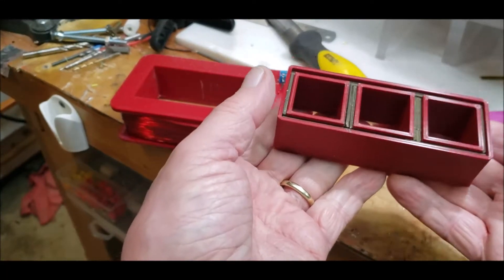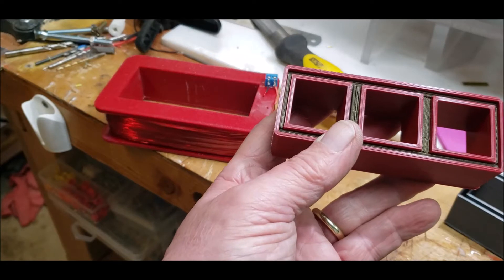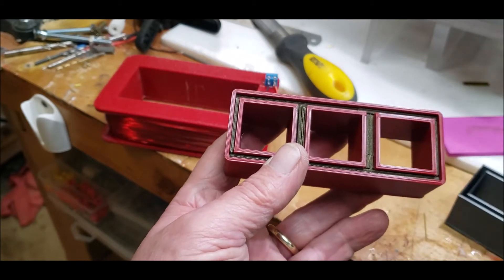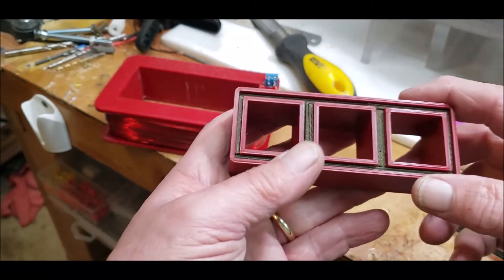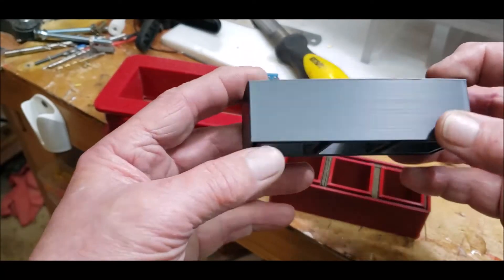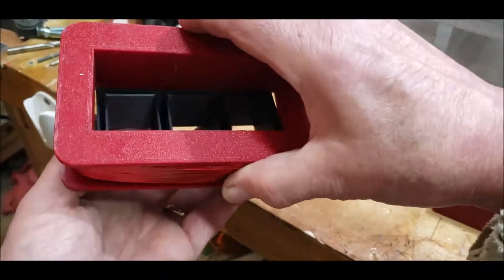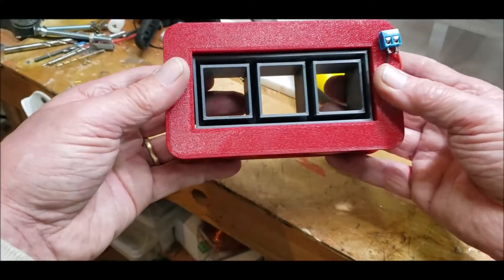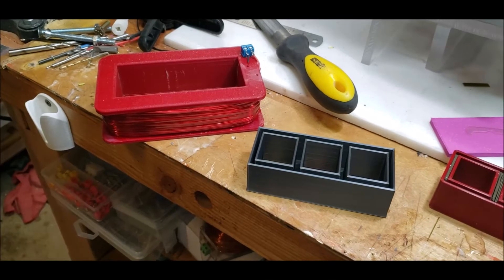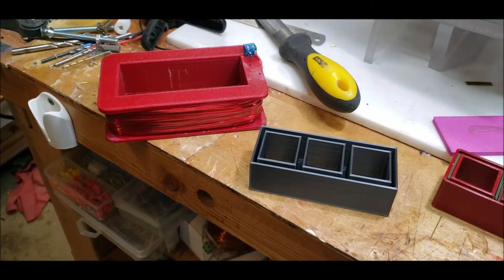It's got a little bit of weight but not too bad, so I think it's going to work out really great. There is a pointed side and a dull side to a pin nail even though they look completely straight, so I put the pointed side facing up. Here's the actual core I'm going to use for my coil — it fits nicely inside. Now I'm going to fill this one up with the shot and then pour resin in both of these.